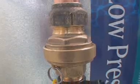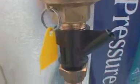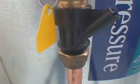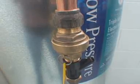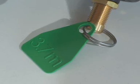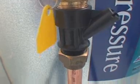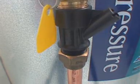On the outlet side of a low pressure installation, we have a relief valve. The relief valve acts as a secondary port of relief to the cold water expansion valve, relieving excess pressure as thermal expansion takes place. The relief valves are available in settings of 37, 76, and 120 kPa to match the corresponding pressure reducing valve used on the system.